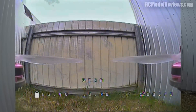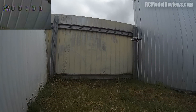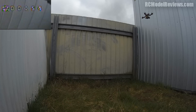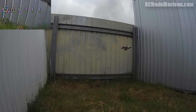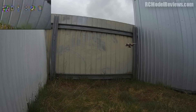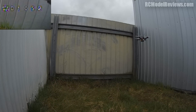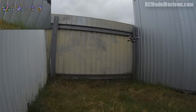Here we go — this could be very long, tedious, and boring. What I've got here is a camera looking at the model and also the FPV signal coming back. Obviously you're not going to see much because I'm just hovering in place, but you'll see up and down, left and right because of the turbulence. I'm going to fast-forward through this obviously. As you can see, the average current draw varies — between three and a half and six amps — and I think the peak current on this flight was seven amps, probably because of a big bit of turbulence where I got stuck in a descending airflow.